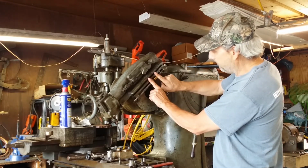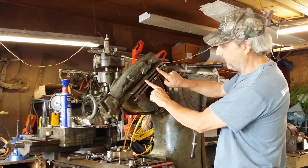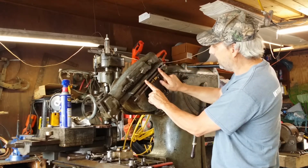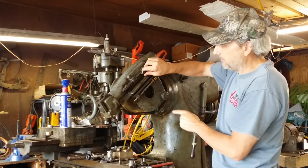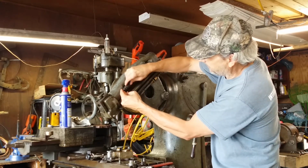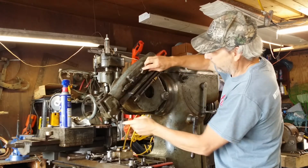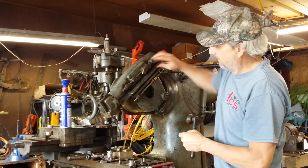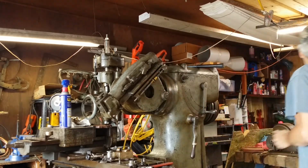So this will actually move the two, I don't know if you'd call them the trips that actually trip this lever up here. Anyways, it moves those in and out, which the purpose of tripping that, if I get this tightened up here real quick, is it's a tool lift for this clapper box assembly. So eventually I want to get this situated to operate correctly.